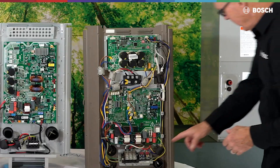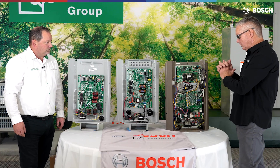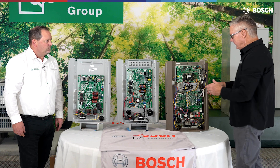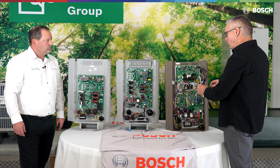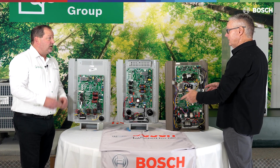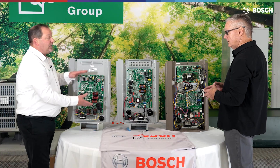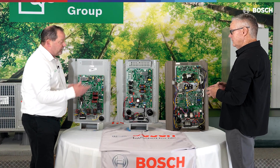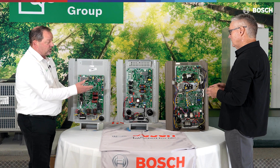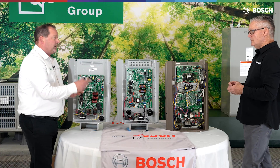On this particular board, we have common blue, yellow, and white terminals that we fit into with our low voltage when wiring it up. When I was reading the IOM, that particular common was brown and now it's gone to black. With that Ultra product, it does come shipped as a communication style logic. If I did want to do non-communication style logic, I would actually have to use the harness that comes in the goodie bag to plug into that. Still the same four-wire connection — it's going to be a Molex plug connection, and yes, our common is going to go from brown to black.